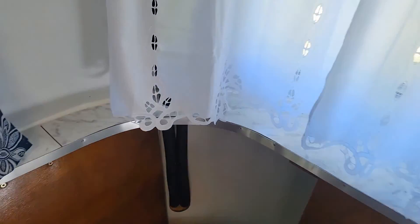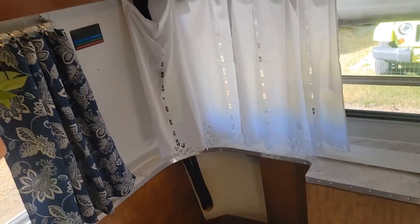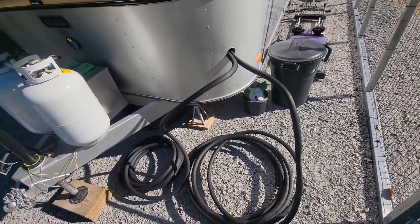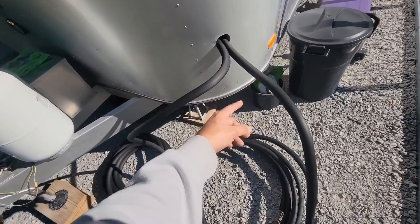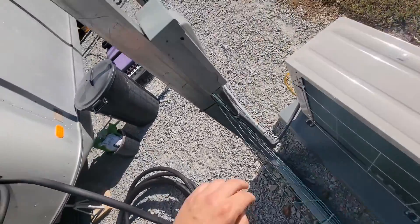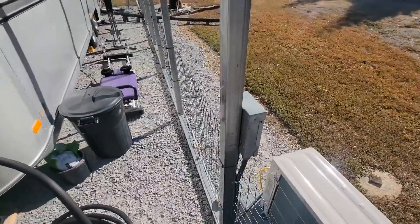Go take a look outside and show you how it looks. The hole is about two and a half, two and three quarters inches. If you've got a hole saw kit, that's what you're going to need — a two and a half inch hole at least. Line sets are rolled up; we cut them to the length we need, and then we nitrogen pressure test and vacuum. You can see where it's coming out right here. We've got to get some drain tube, but the electrical is pretty much almost done. All we have to do is wire it into the outdoor unit.